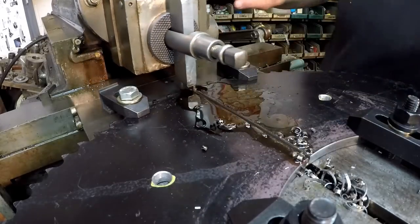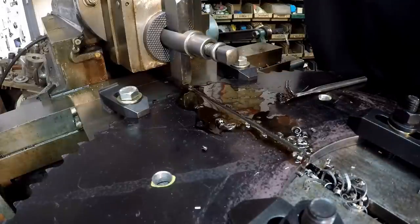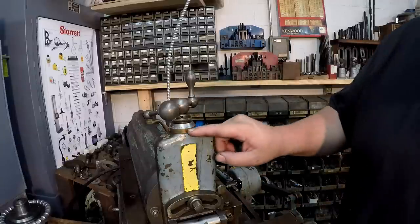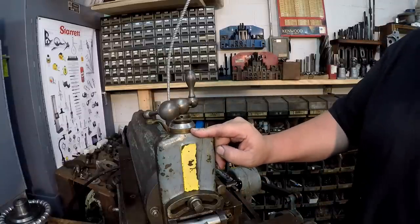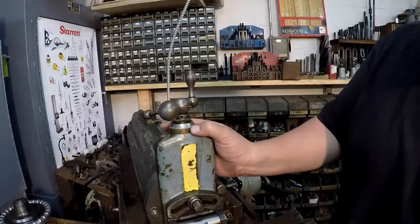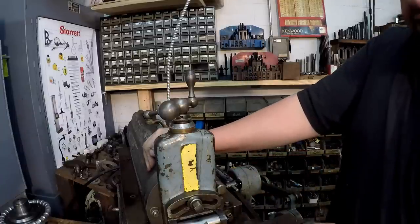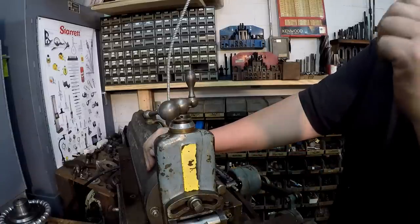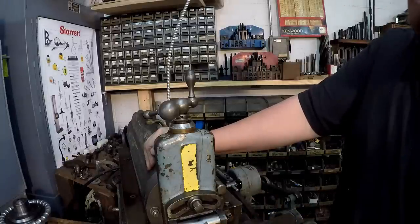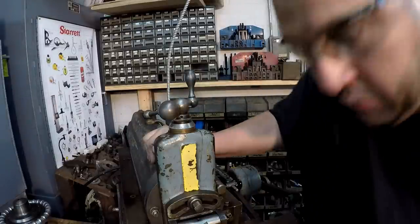Second. Looking down the cut, everything looks pretty good. So on the dial up here, looks like whenever I move it 5 thousandths on the dial, we get a nice, heavy, consistent cut. If I just try to dial like 2 thousandths right here, it seems to want to just kind of bounce off there. And there's probably a couple things affecting that. Maybe my tool isn't the perfect grind for this, and I've got a lot of tool stick out as well. It's kind of bouncing around. But I'm just doing the best I can here, but it looks like we're finally making it through there.